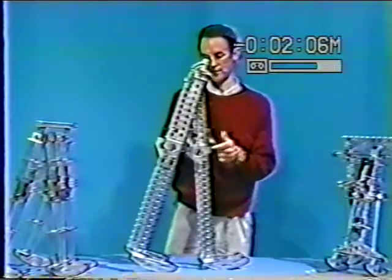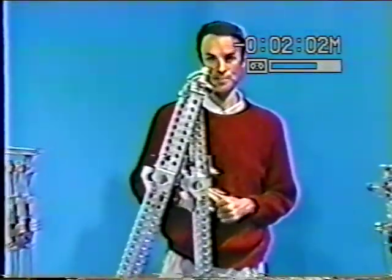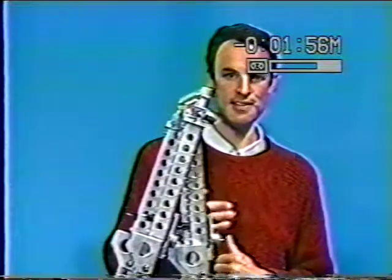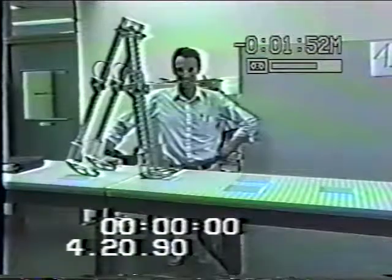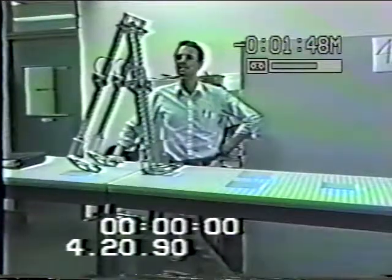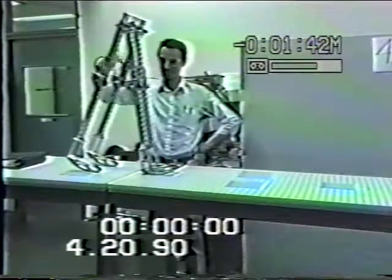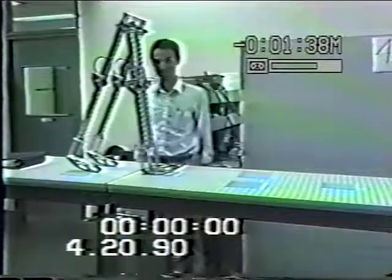Dampers were installed at the knee joints to prevent knee bounce, but they turned out not to be good enough. For later experiments, we went to a set of mechanical catches. The next sequence shows our first trial with those — here we are on the date indicated, and the slope is four and a half percent. The new twist today is that we have installed four knee catchers, one on each leg.